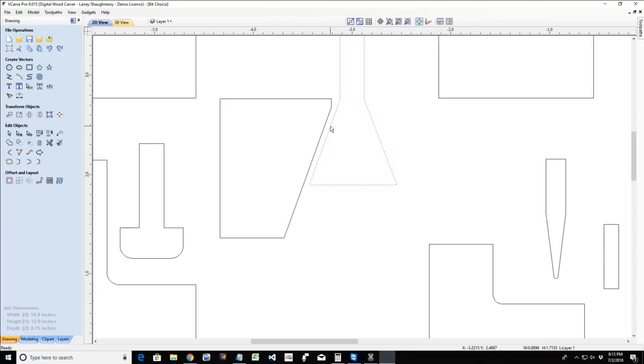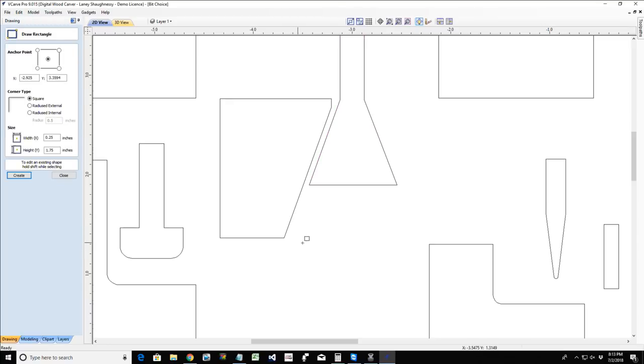And we're going to talk about keyholes and dovetails and things like that later on. The edge jig or wedge jig, I've got it all drawn up, but I don't have the instructions. If I give you the picture drawings, a lot of you will be able to figure it out, but there's some that need instruction, especially on how to create those keyhole tool paths, the T-track tool paths, but using a keyhole bit to do it, not a T-track bit. And a T-track bit is, let's say that we have, bear with me a second. Let me see if I can draw this out.